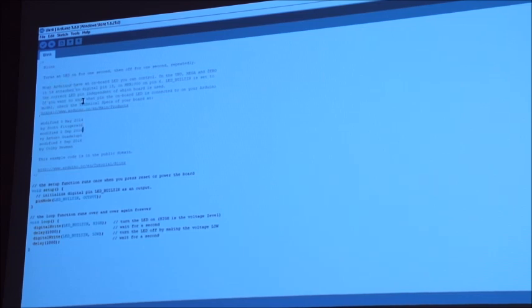So at the top there, this isn't going to be a coding area, but what this code does is it blinks the LED 1 second on and 1 second off. The other thing that they've done with Arduino is because they know that you don't necessarily want to buy an LED, they've built an LED in there so that you can play with the LEDs, so you don't need anything other than this if you want to flash LEDs.